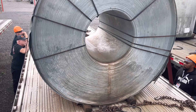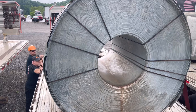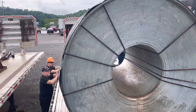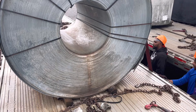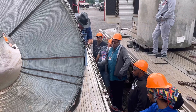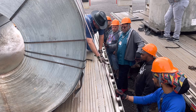Chain — you X them inside of these, like a spider, keep growing legs. On a shotgun coil, you'll take that coil rack and set it evenly with that stake pocket. Try to set that coil rack even with your stake pocket. When you set that even, you're going to have about eight inches of wood sticking up past your coil rack. So if my coil rack's right here, eight inches of wood is going to come up to about like there.